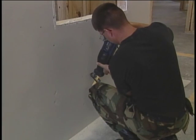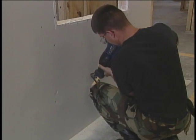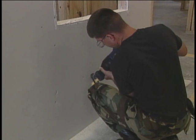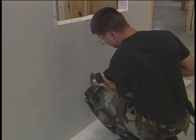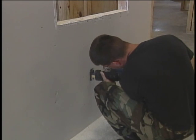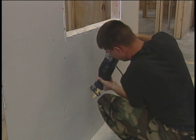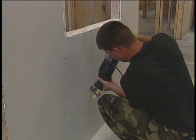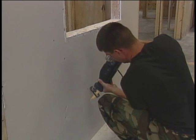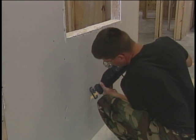This saw is also capable of making plunge cuts. A plunge cut is made in the middle of a piece of material, such as sheetrock or plywood. You can start this cut anywhere inside the area to be cut. Align the blade tip with and hold it just above the cut line mark. Place the base assembly on the work and hold it firmly in place.